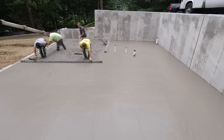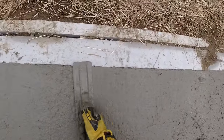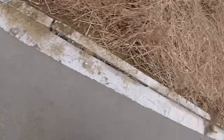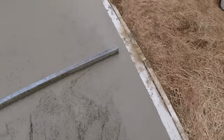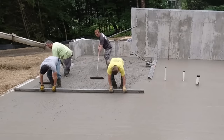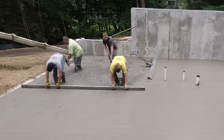There's a little bit of a difference obviously between hand screeding like this versus vibra screeding - which way do you think you guys would do it? I think you're gonna pick the vibra screed, especially if you've never screeded concrete by hand. That's what magging the edges looks like right there, matching the top of that wall - and the guys spread hay over the loam and made quite a mess with it.